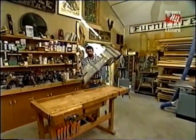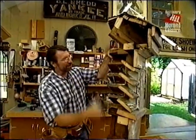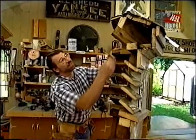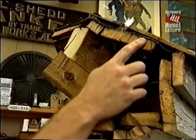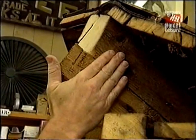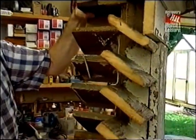Well, since the original cupola was beyond repair, I took my reciprocating saw to it and cut out one of the corners so I could take a look at the construction details. They had a wood shingle roof that sat on some heavy felt paper on top of 3/4-inch thick roofing boards. There were four hip rafters that sat on top of a plate that was half lapped in the center. Then there was a stud down the corner. The rest of it is pretty much trim.